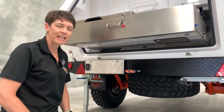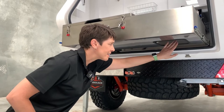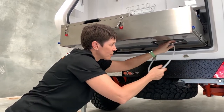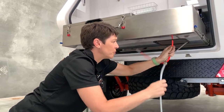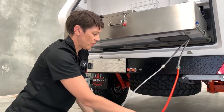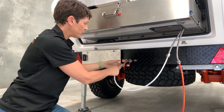To connect the water in the back end of the She-Oaks, the hoses are underneath the sink section, tucked away in here. Drag those out — there'll be two: one will be white and one will be orange. The white one indicates cold, which has got the blue end.